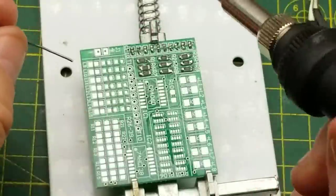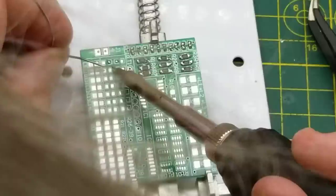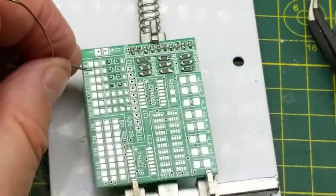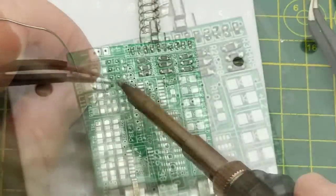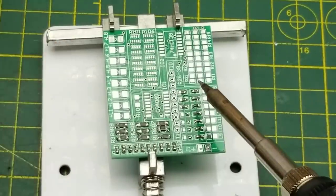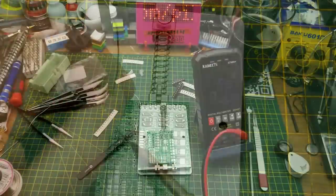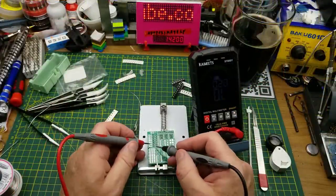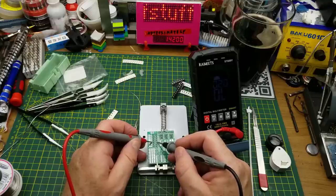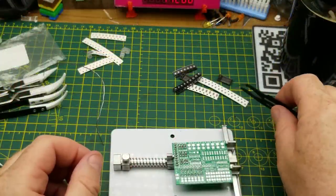I'm not sure what order I'm going to do these in - I think what'll work best is if I pre-tin the ones that are in between and then do the rough soldering out here. Order of operations seems to be a big deal for these things just so you don't get yourself completely screwed up. These ones were hard to read coming out of the package but they look like they're about 180 ohms each - 360 across both of them. I seem to have gotten an electrical connection to all of them.